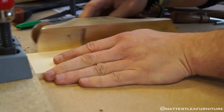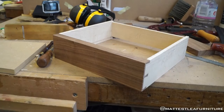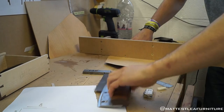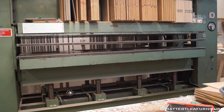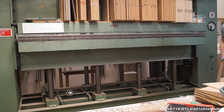The drawers are a little bit weird and very difficult to explain — you need to look at them closely to see how they're constructed. Essentially you need to make it offset at the top so it creates an air gap when you're pushing it in, and at the bottom so you can slide the base in after it's assembled. I found some offcuts of what I think is cherry — it smells like cedar, possibly because it was stored in the same drawer. Cedar is a traditional material to use on the inside of drawers and cabinets because it smells nice and also prevents moth attack, so I'm trying to stick to tradition.